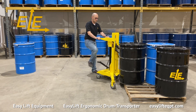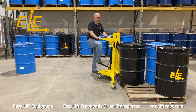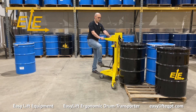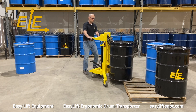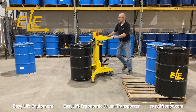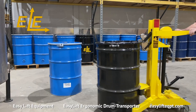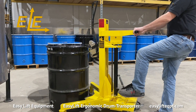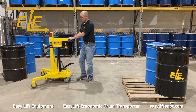It is recommended to apply slight forward pressure as you raise the clamp to ensure a solid grip. Continue to pump the foot pedal, allowing the pedal to travel all the way up and pressing completely down to achieve the full one-inch stroke. Ergonomic drum transporters require the operator to place or remove drums from the corner of a pallet. Never under any circumstances should you lift or suspend loads over people.